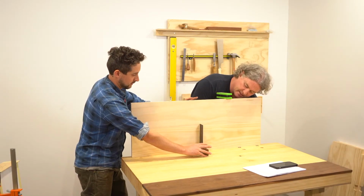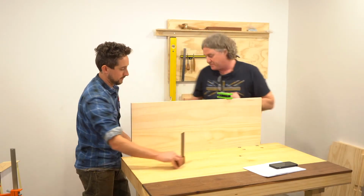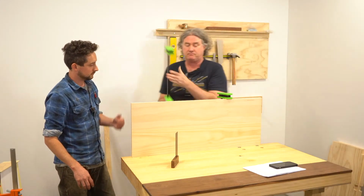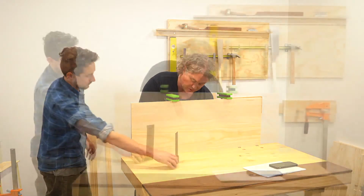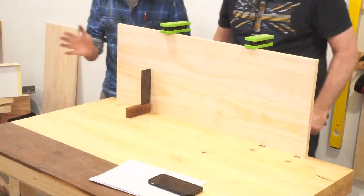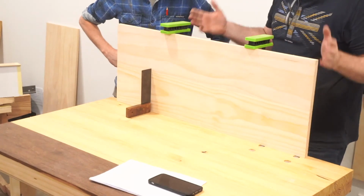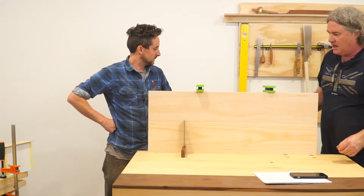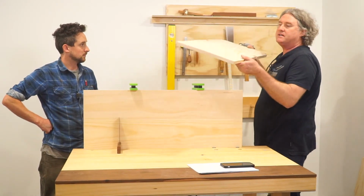Now, where are we sitting? See? Wow, first time. Pretty good. That's going to sit there and hold in position. Probably a good idea to put two up because, if it falls off on the floor, well, that's just what you call a disaster. How are we going for squares? Beautiful. Absolutely excellent. And this is the perfect size because we can do both sides at once. It's a small bench, but we can use the bench as an inherent part of the glue up, which is great.